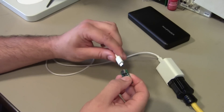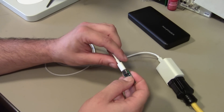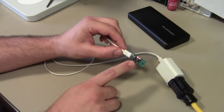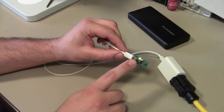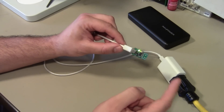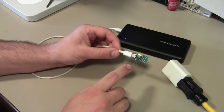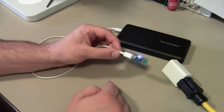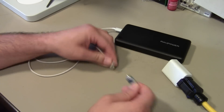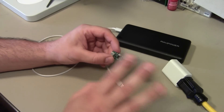Then if we put it back in program mode again, after purple there's a white mode. What the white mode does is have the controller just cycle through all of the options. On the cell phone charger which only supports 5 and 9 volts, every few seconds it switches between red and yellow — on the output bus it's actually going 5 volts, 9 volts, 5 volts, 9 volts. But if we plug this back into my full voltage range battery pack, you can see it goes red, yellow, green, teal, blue, back to red — and it'll just sit there and cycle through all of these voltage options. This is pretty handy if you've got some USB-C device and you want to find out what voltages it supports — you can just plug this into it, watch the LED, and it'll scan through them.